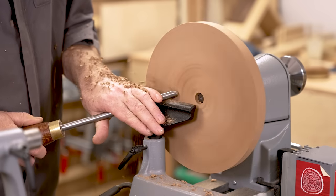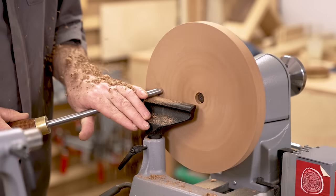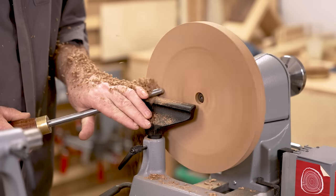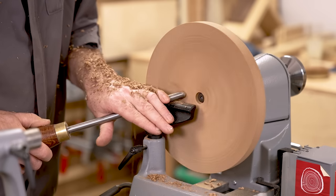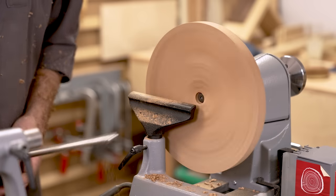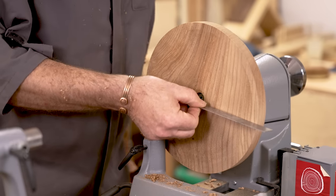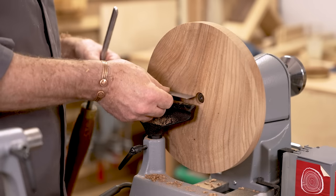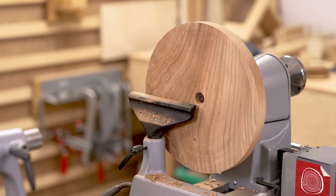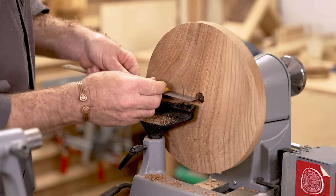Cuts are gently getting longer. So again, just really roughening this out. How do we know where we are? We can use a ruler, bridge across, so I've probably got my 6mm. Are we flat here? So by putting the ruler on, we can check we're nice and flat. We've got a little high spot. Again, good little tricks on this instead of trying to remember where you are. Got one there, got to blend in here. This bit at the moment through here is hollow.